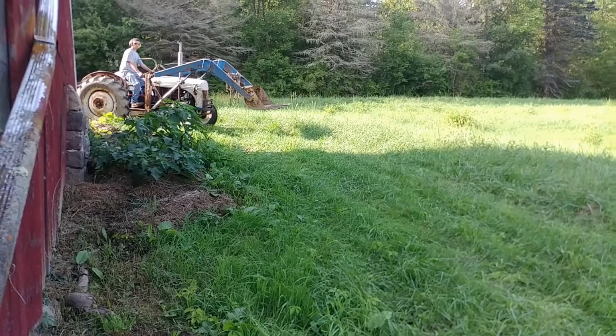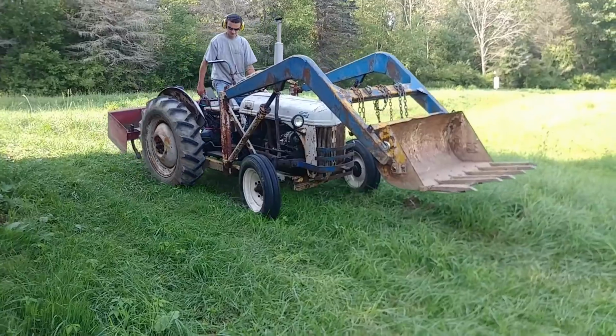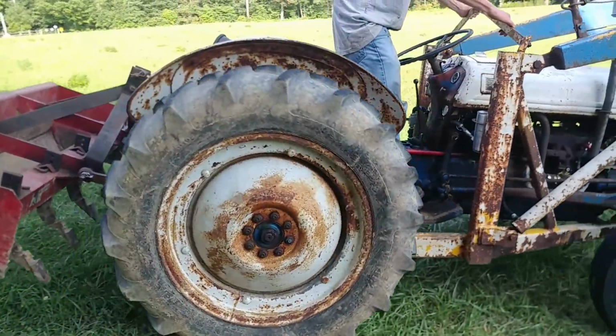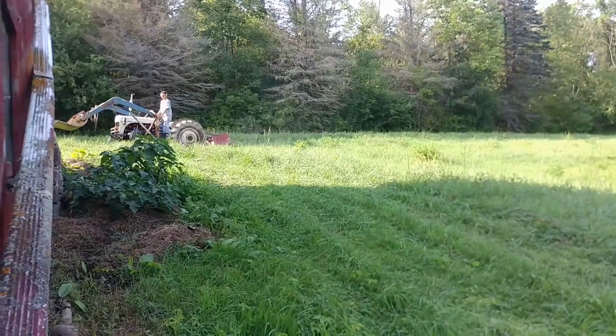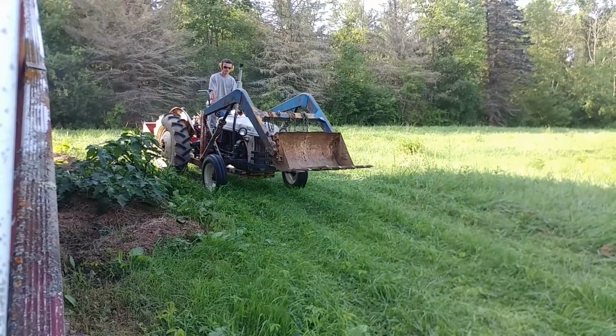So we didn't have any brakes before, and I don't know that this has fixed it. But I told my brother to drive around and just stand on the pedal and mash on it. I want to see that tire lock up, and hopefully we can get this thing to work. I'm not entirely sure. The brake pads look fine, so the only thing that I could think of was maybe the drum or something. I don't really know, so we'll see, I guess. The more we use the left brake on this tractor, it seems like it's sort of working more and more, so I don't know if stuff just needs to get used to being used again. My brother mentioned that it sort of locked up the left tire the last time he used it, so I guess this brake is sort of coming back to life.